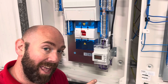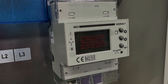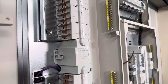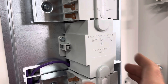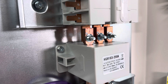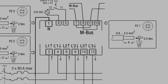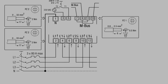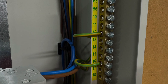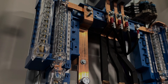The real magic is here — the HGR43T meter, which is included in every one of these power and lighting distribution boards. It's a clever piece of kit: it communicates with each pan, and behind these covers are CT clamps which monitor each phase, with a data connection heading back to the meter. All this communication is done through the Modbus protocol, which ensures simple energy visualization on the meter screen. I also like that the earth bars are directly opposite your MCBs — it just makes for a quicker and neater install. And the neutral bar is shrouded, which affords IP2X protection.